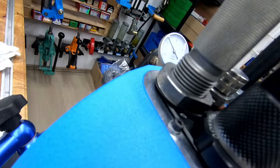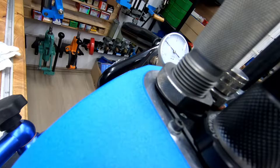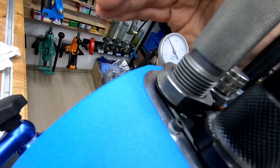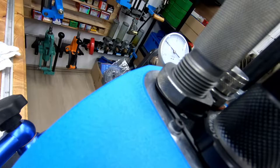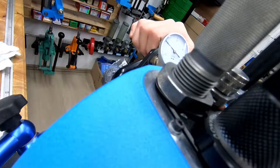Okay, so I'm willing to sacrifice a brass case now for you here. And let's just get a baseline first. We're moving just past, like, one of these little lines is half a thousandth, so this is probably a thousandth past the five. Let's try it again. Yeah, there we go. Okay. Let's put one case in, and I'm just using the expander mandrel now. Yeah, we're almost there. We're just a thousandth below the position that we got early on.